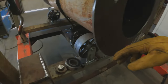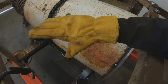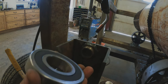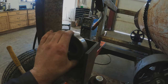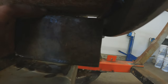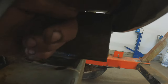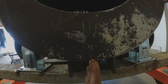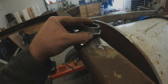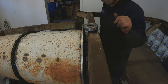With our end cap tacked in, we can now install our thrust wheels. I'll install one at the very top to prevent the barrel from walking up — that occurs if your rollers are misaligned. Since these aren't adjustable like the big trommel, I'll add one anyway. On the bottom I'll install one to prevent the barrel from wanting to walk downwards. I'm using these big bearings — the collar just threads on and holds the bearing in place. The thrust wheel welds to the cross beam, slides into place, and the bearing must have no gap between the top and bottom. Remember this bracket is at the same angle as the trommel, so it should be square and the center of the barrel should line up with the center of the bearing. For the top one I also made another collar on the lathe — we angle it to the barrel angle, keep these tacked on, run the trommel to check all tolerances, and then fully weld them up.